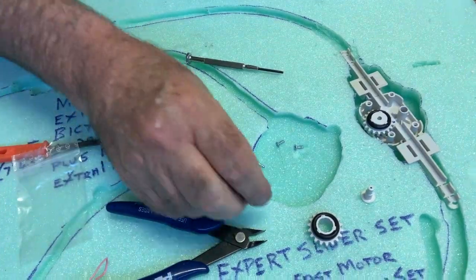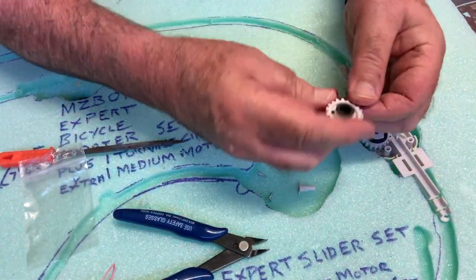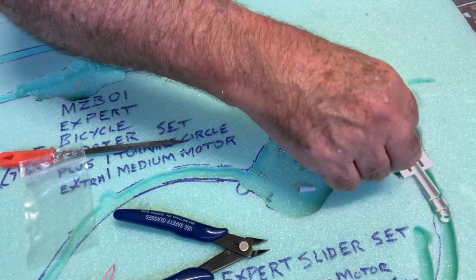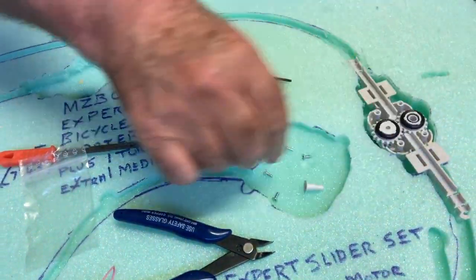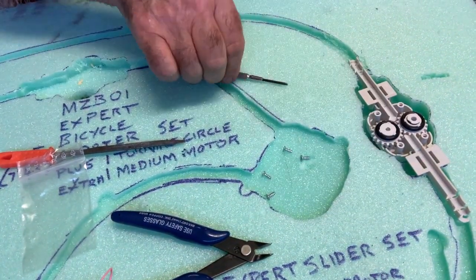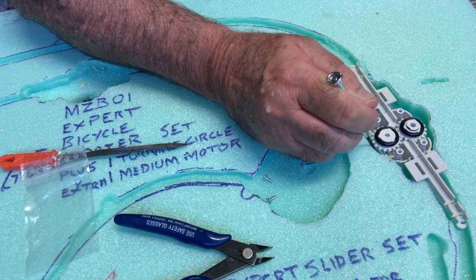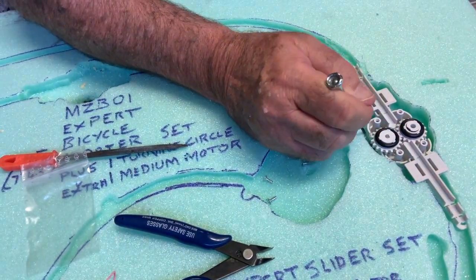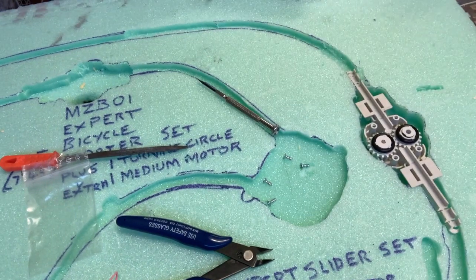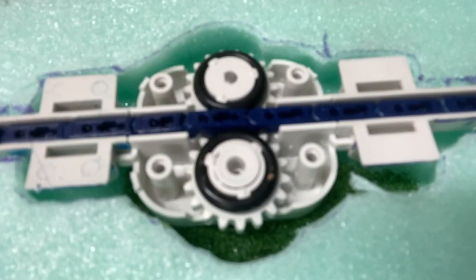Slip on the sleeve on the inside, which runs on the underneath plastic. Push that in — it has a stopper to stop it from rising out — and the gear should just mesh perfectly. Just check that there's no clicking and make sure you've got rid of all the sprue.